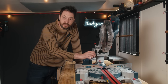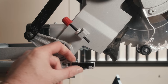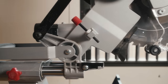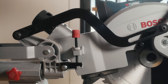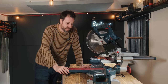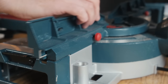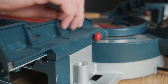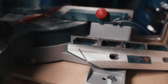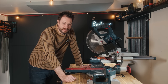The saw does have the ability to do trenching cuts, not that I've tried it yet. You've got a little stop that folds down and then you can screw down with a locking nut - all looks nice and secure. It's not a feature I use often, but it's definitely nice to have. Another feature worth pointing out is at the back you've got a little thumb screw on the back of each fence, so you can slide them out of the way when you're doing bevelled cuts. I might have forgot to do this once on my previous saw, but I think after you've done it once, you'll remember after that.